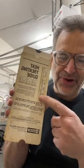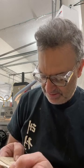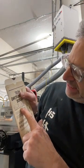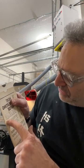It is interesting, Warren. The whole heat treating thing is really kind of cool. I have this slide rule here, that box of foil. I got that box of foil when I bought that Blue M oven, and it also came with this slippy slidey calculator. And it says right here, for A2 tool steel, you preheat to 1450, hardening temperature 1700 to 1800, quench media is air, and as-quenched hardness is 63 to 65 Rockwell C.